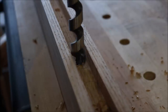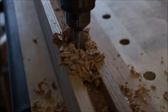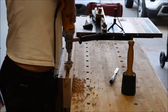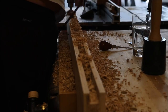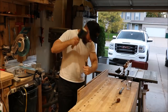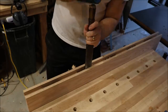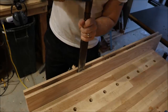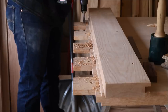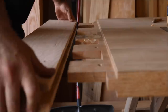Now I'll basically do the same thing as before and drill out the bulk of the waste and chisel out the rest. I tried thinking about how I could do this without using a chisel but I couldn't think of anything - so if you have an idea on how to get a four-inch deep mortise with just regular affordable power tools, please let me know in the comments. I use the drill press again to drill holes in the breadboard ends, then made my marks on the tenons for the offset draw bore holes, and the same as the other side, I take a rasp and elongate the holes on the outer tenons.